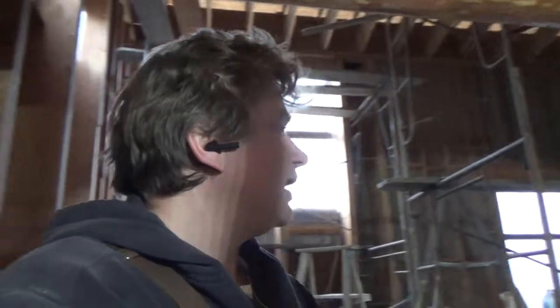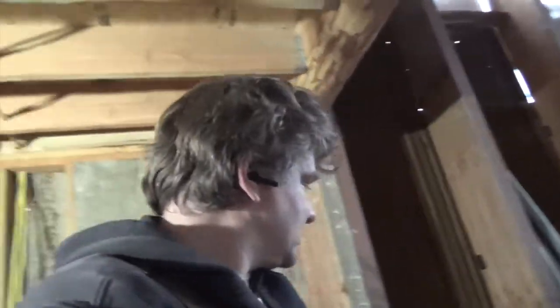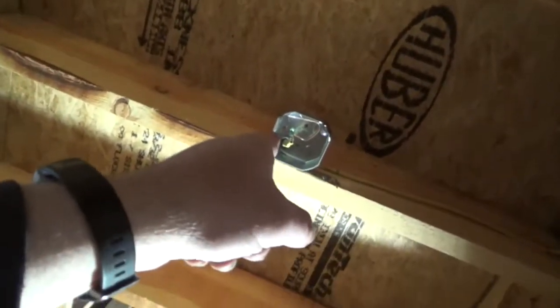He wrote some notes in our little copy of the electrical handbooks for us. He walked Danny through. Oh, and I have the Romex connectors, where the wires come through the box. He says I've got all those too tight, so I need to fix that. And he set 2 in the kitchen so that I could base it off of that height right there.